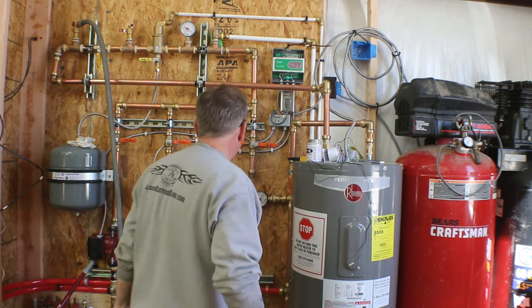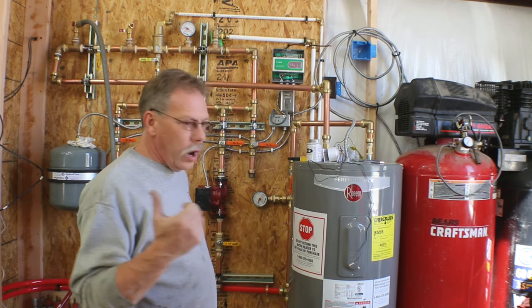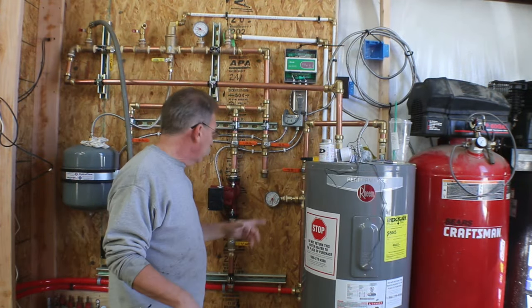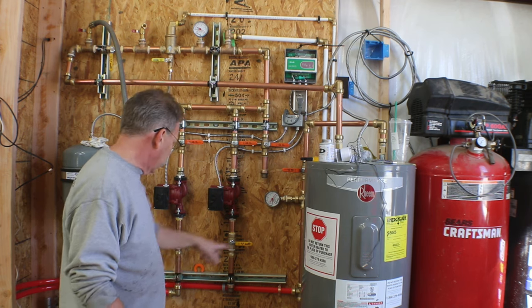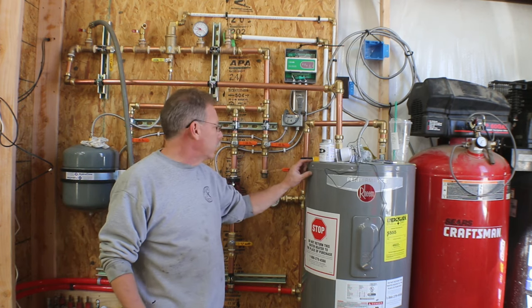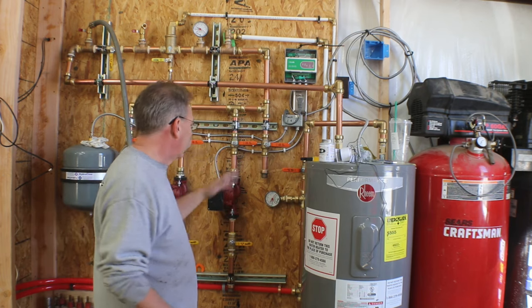Put some pressure off. We had about 7 or 8 pounds of pressure building up in there. We'll just keep an eye on that. Once it starts running water steady, we'll know this tank is essentially full. Okay, so it's taken a few minutes, but we finally have gotten all the air, best I can tell anyway, out of the system. And we've started water all the way down. It goes out to the hose and it was running pretty clean. I could hear a little bit of bubbling in here still, but the pressure dropped to zero, which tells me there's really nothing building in that tank, and we've gotten all the air out of that system. So I've shut it off.